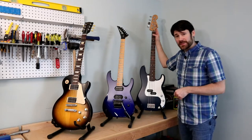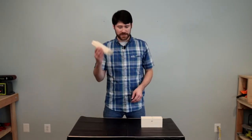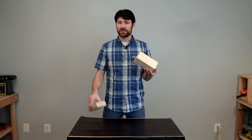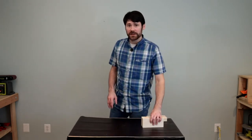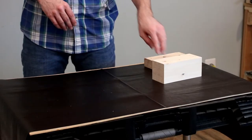We're going to use these to actually fix the bass neck later. What we need to do is take each one of these guitars and bring them over to a table along with our blanks to create the neckrest cradle and measure out how much material we'll have to remove. We've got two blanks: a two by four that's seven inches long and a larger block which is three by three by seven. We'll use both as two different neck supports for different styles of headstock. We need to measure on the larger block our two higher angle headstocks and determine how much material we'll need to remove.